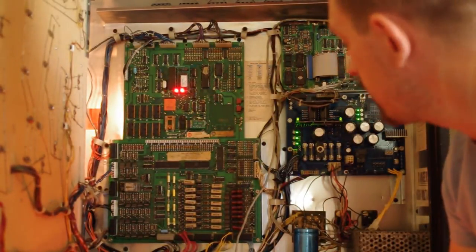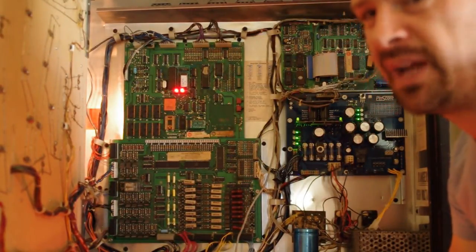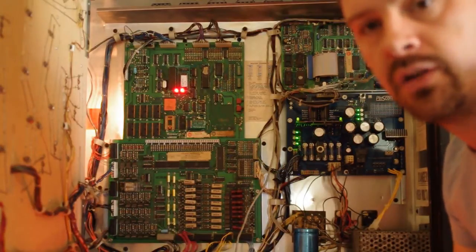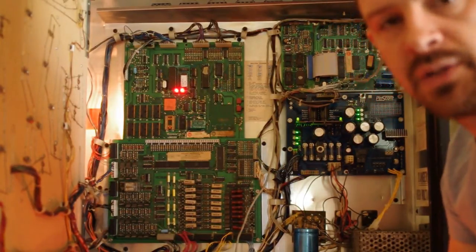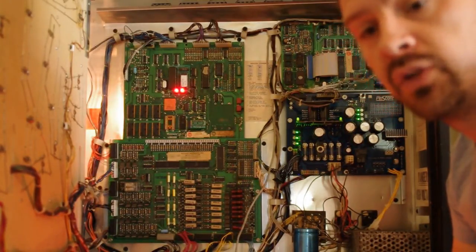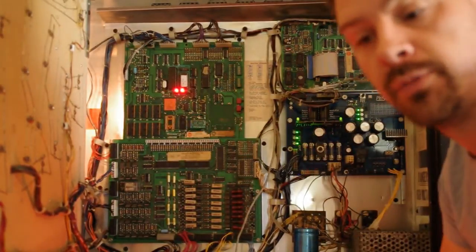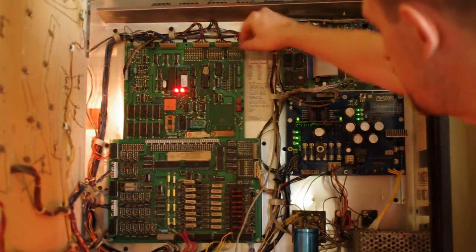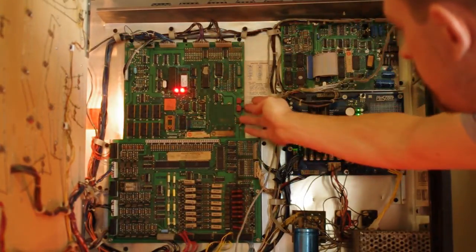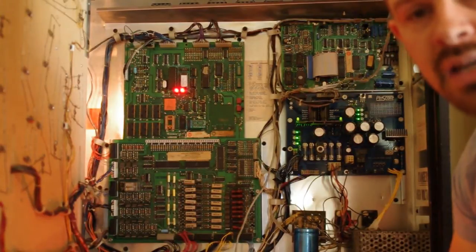There are a couple of other commands you can do with the DIP switches — I very rarely use them, but they are covered in your manual. Basically it's for clearing memory, clearing audits, and also what they call an auto cycle, which is a diagnostic mode where it cycles through the various modes. It's nice to know the clear mode if you run an NV RAM option, because you can't just pull the batteries to clear the memory since there are no batteries — it will constantly store that. To do that, take your second DIP switch down on the top bank and press your lower button. You'll see the two LEDs blink and it should clear out everything in the game.